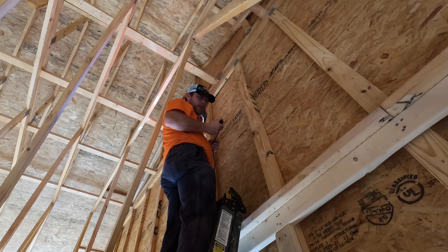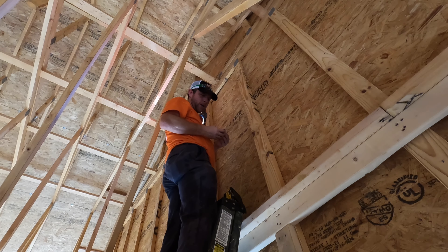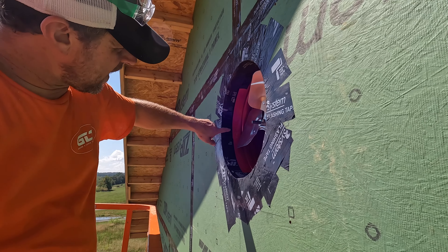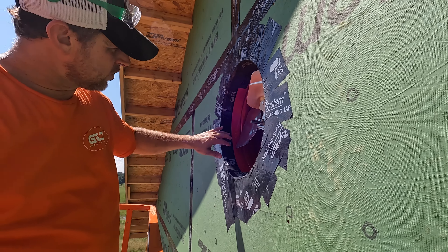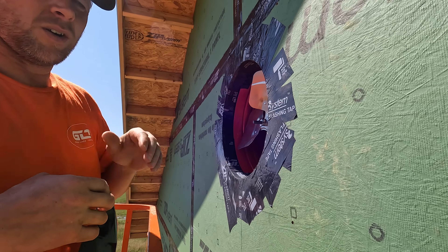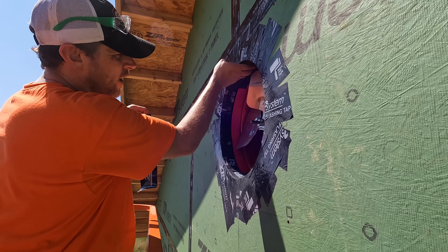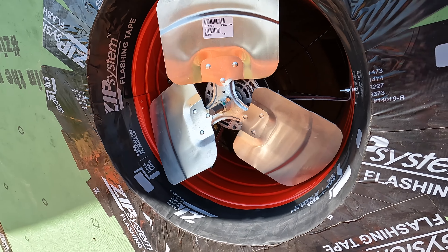You can hardwire these fans in or they come with a plug, so I'll just have an electrician run me an outlet up here so we can plug it up. I'm going to screw this control box up, then go back outside and tape it off, and we'll have this one in. Back on the outside — I've got just a little gap where I put those rubber pads on the mounting brackets, which hold you off against the wall a bit. I'm taking this zip tape to seal that seam so it'll be seamless all the way through the fan — when that air is coming out there won't be any pockets, just a smooth transition all the way out. That's got her pretty well sealed off.